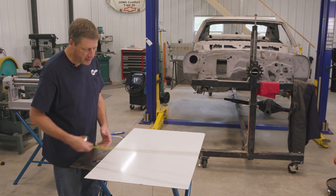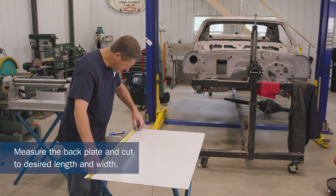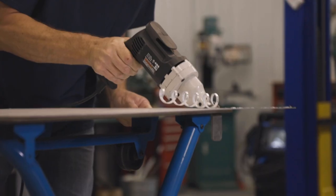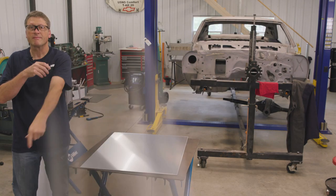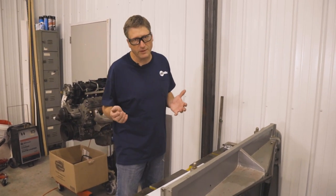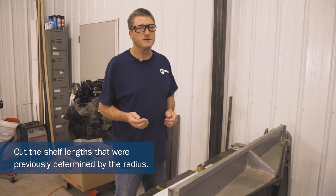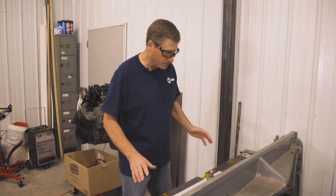The back piece where we're going to weld the shelves is going to be 24 inches by 28 inches. The shelf width is four inches, but the lengths are determined by the radiuses. My top shelf will be 33 inches long, the next 26 inches, followed by a 16-inch shelf, and my smallest shelf will be 10 inches. We're going to cut those right now.